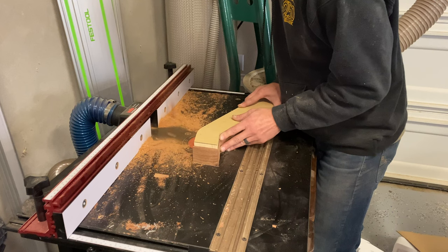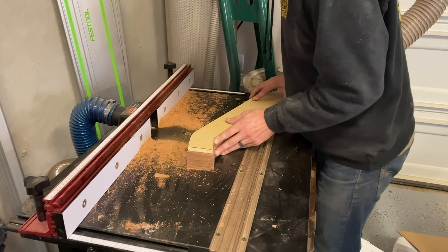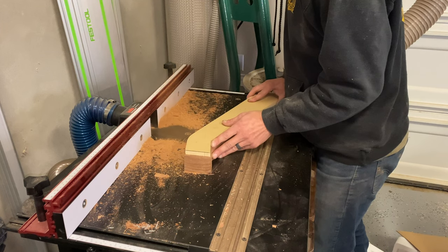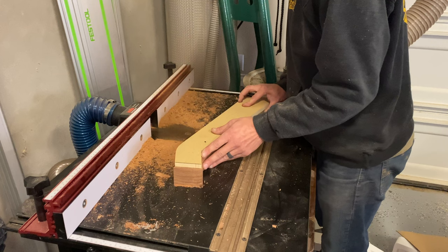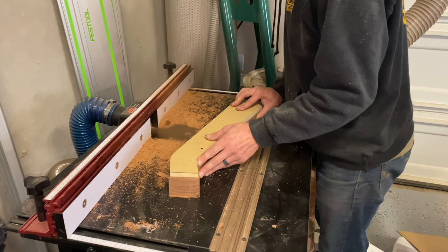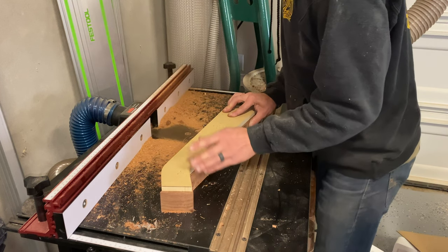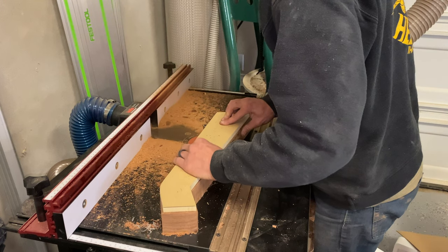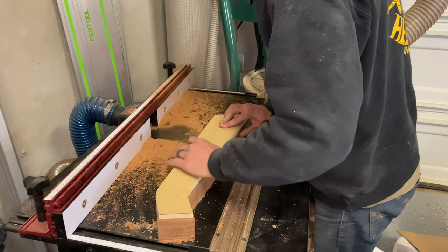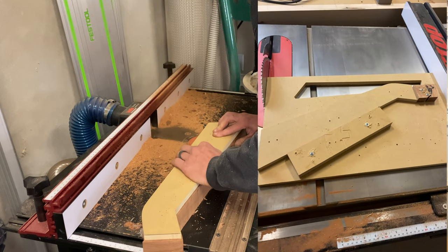It's important to go slow. I'm using a quarter-inch collet router bit, but for something this long you might be better off using a half-inch — I've had a couple of these break. Wear eye protection, and I'm using a starter pin so I can keep my fingers well away from the bit.